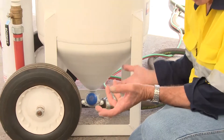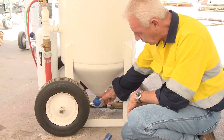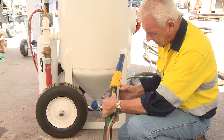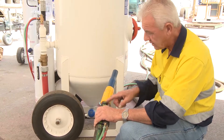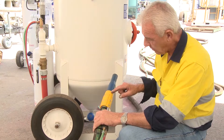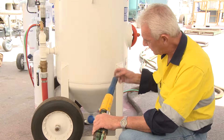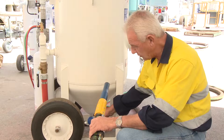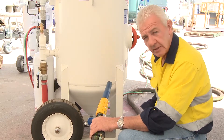How do you check if you've got the right amount of grit? You'll notice that when you screw that valve all the way in, push the safety pin in, and depress the dead man handle, there's a screaming noise. That screaming noise is indicative of the fact there's only air coming through. The scream originates from where the venturi of the nozzle starts, and as it exits it's basically just the air coming out. Once you start introducing grit into that airflow, the scream diminishes.